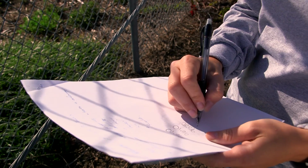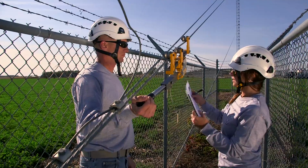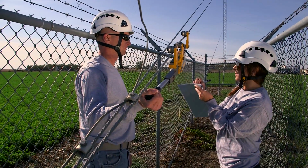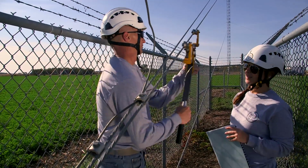If anodes are installed, voltage readings need to be checked and recorded, which will determine if the anodes are still properly functioning and not dissolved. Further anchor investigation may be recommended or required depending upon the history of the structure.